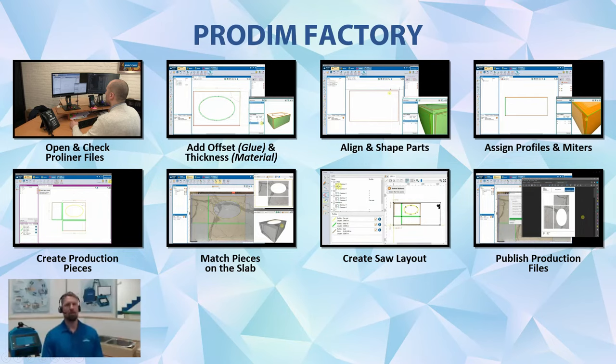All right, so that was the first section of the video, measuring with the Proliner. The next step is we're going to bring what we did from the Proliner into the Prodim factory software. This is where we can actually align our parts and add a thickness of the material, basically extruding the shapes to the thickness of the material. And then we can paste that geometry onto one of our digital slabs that we have saved in the Prodim factory software, so we can get a very accurate and nice looking vein match and have this ready for production.